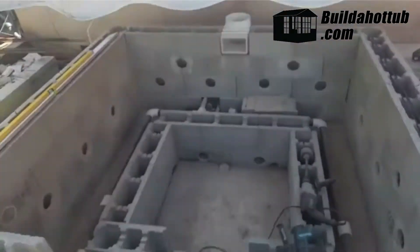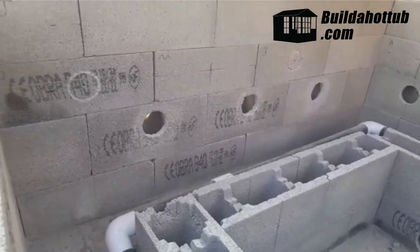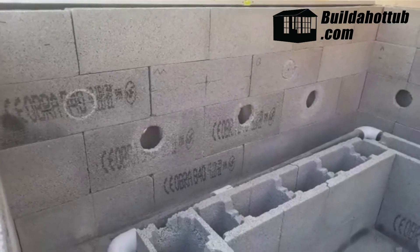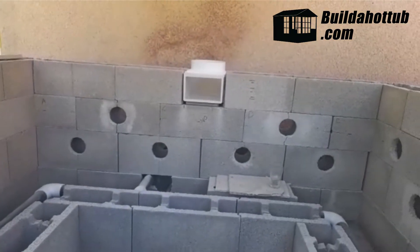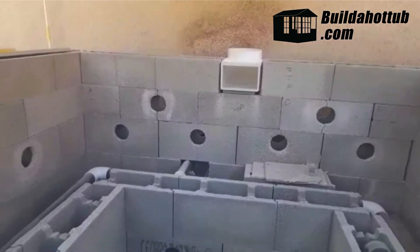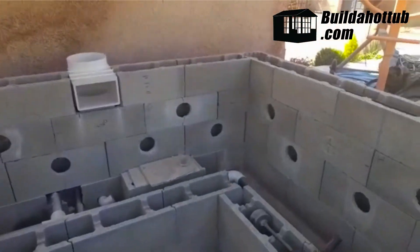You'll see I've got a mix of blocks in here — three courses of 200mm and one course of 250mm. That was just to get the right height finish I wanted. I've managed to drill the 250mm blocks okay, but the 200mm blocks — you can see two over there at the top — they've both split. Luckily I got all the way through them before they split, but mostly, as you can see by my waste pile, it's just impossible. Those two are still usable, they're okay.